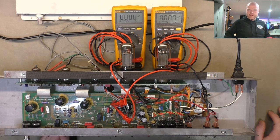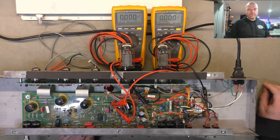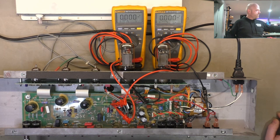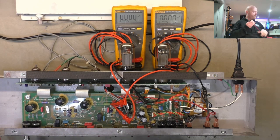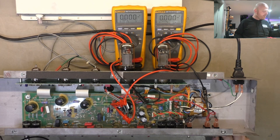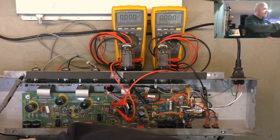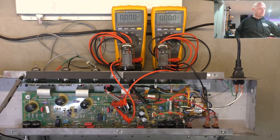We'll just confirm that there's no crazy current draw for starters. And then if it's all looking good, we'll bring the variac up slowly. And if we're approaching operating voltage without any issue, we'll give it the full mains voltage. But first, we'll give it probably 10% of the mains. And we'll just check that we've got bias supply on all the relevant pins and that all our plate connections are receiving HT. We've got both the standby and the power switch on.